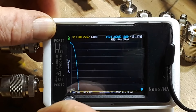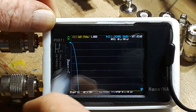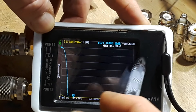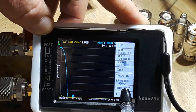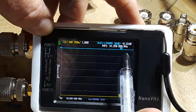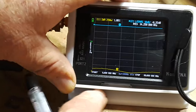The yellow line down here is our reflected signal — that's the signal coming out of port one and being reflected back in. And we have our loss, which is the signal being sent out of port two into port one. I can scroll across the bandwidth here. I accidentally toggled transform on — I don't want that. There we go. Now I've got our sweep going again and you can see the frequency we're at.